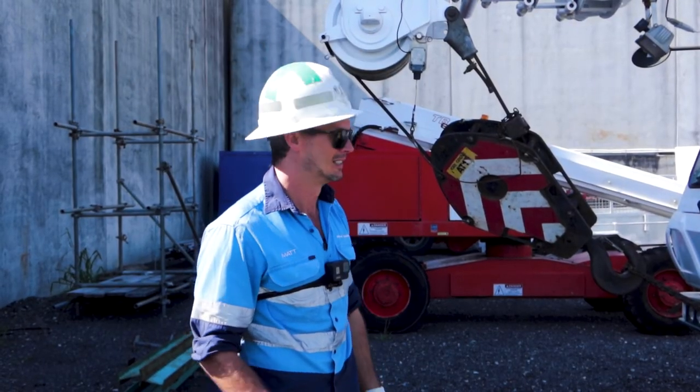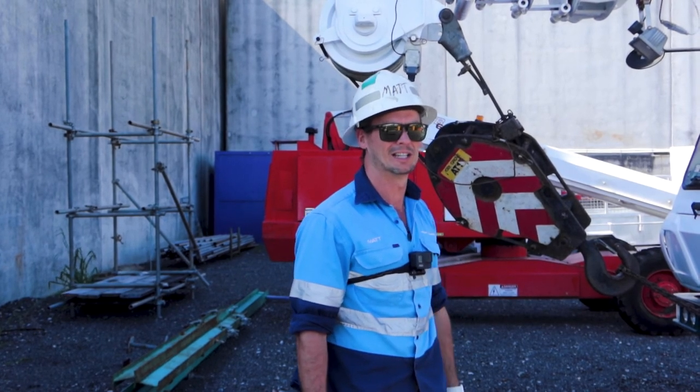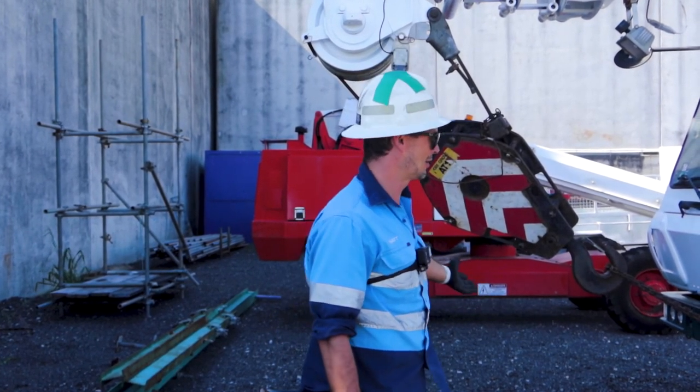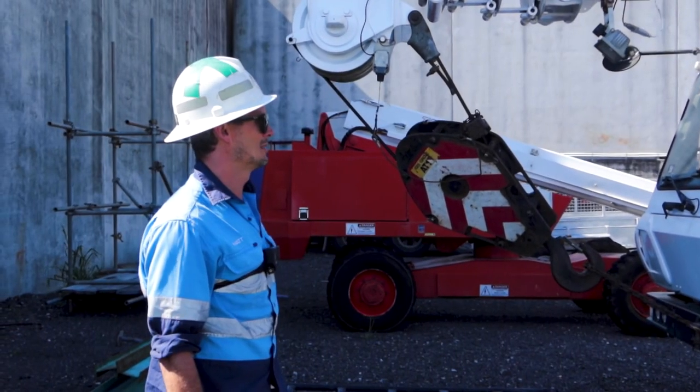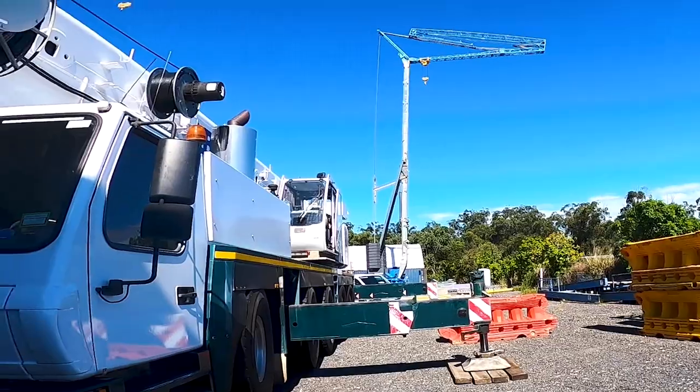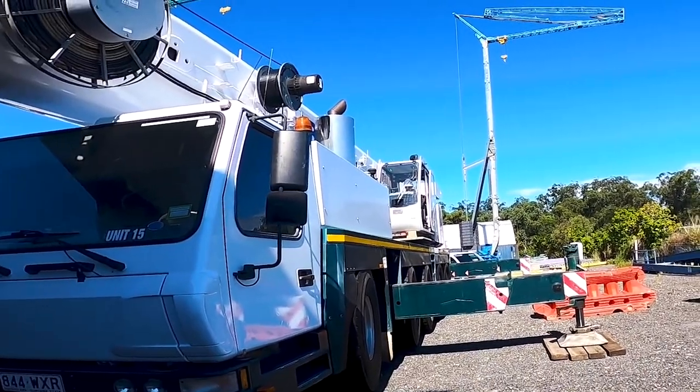Great idea. Little winch on the front there, get rid of the risk of doing that. So little winch, you can release it while there's no power to anything, and he can just boom straight up. So at the moment, telling his computer, he's got no counterweight on board, full outriggers, how many parts of line he's running. Should confirm with the computer shortly.